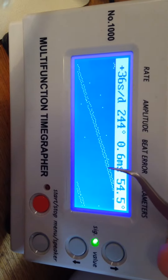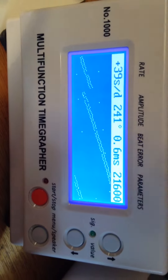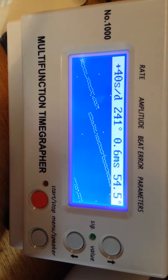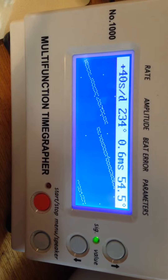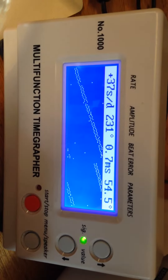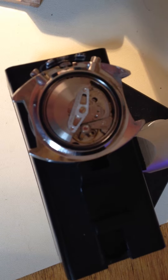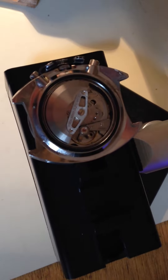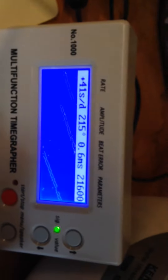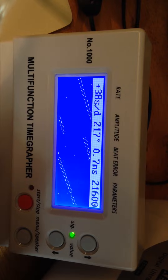The movement still looks good — we're getting straight pumping lines, a little bit of noise, nothing major, and the numbers are dropping a little bit. If this were my watch, I wouldn't trust those numbers at all. The watch does not look like it's ever been serviced, and even if it's showing good numbers now, it's not going to show them for long if run for a long time. I'd go for the service just to make sure, because the numbers are dropping.